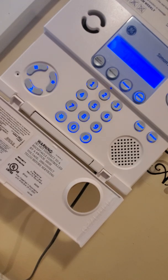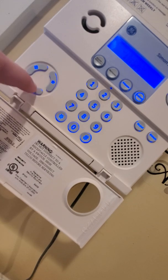If the system's dialer was hooked up, it would have said alarm communications have been canceled. However, this again depends on your monitoring situation, your installer configuration. If it's a DIY system, it will not have that unless your phone dialer is hooked up, which we will discuss in another video. The fire panic, please be aware, does not usually have a delay. Again, ask your installer for that. You just got to press 2 seconds.